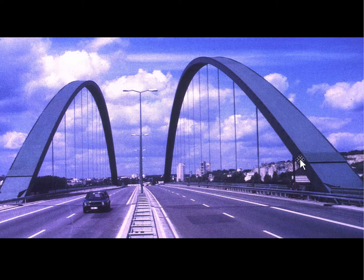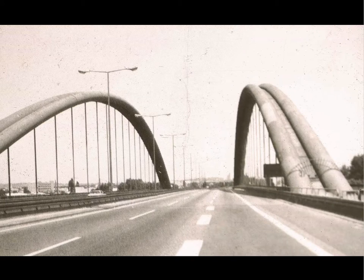In this case the cross section of the arch has been made much wider. Implicit in this is a good moment connection somewhere down below where the arch attaches, so that the bending action at the base can help stabilize the top of the arch through beam action. This is the same principle applied more elegantly — two round tubes knit together with a web in between.